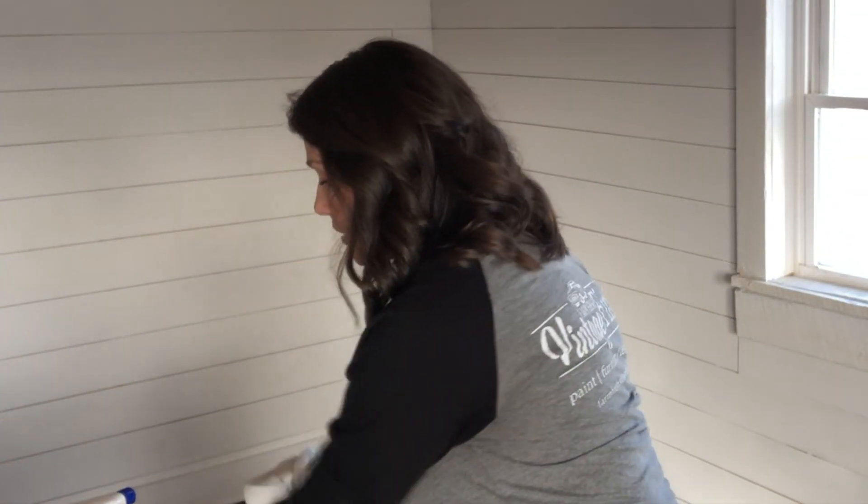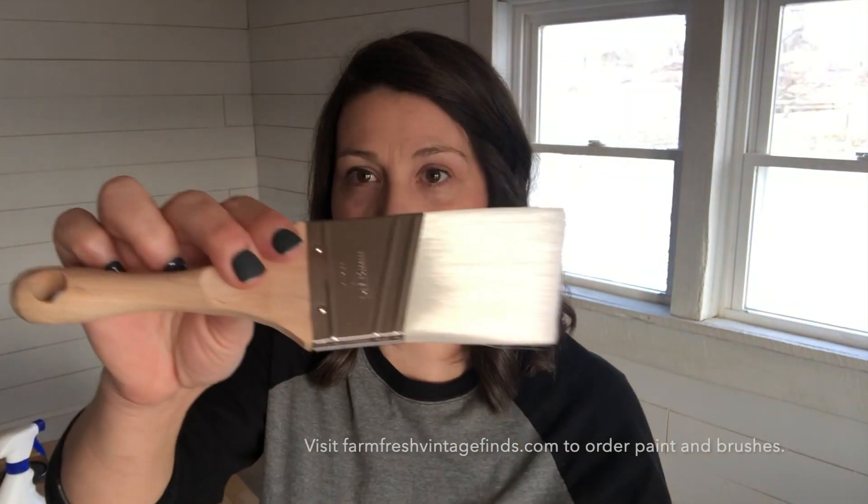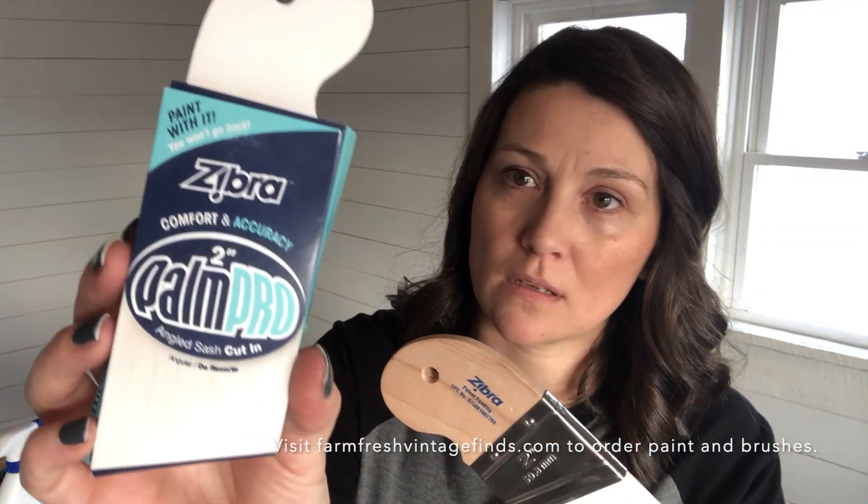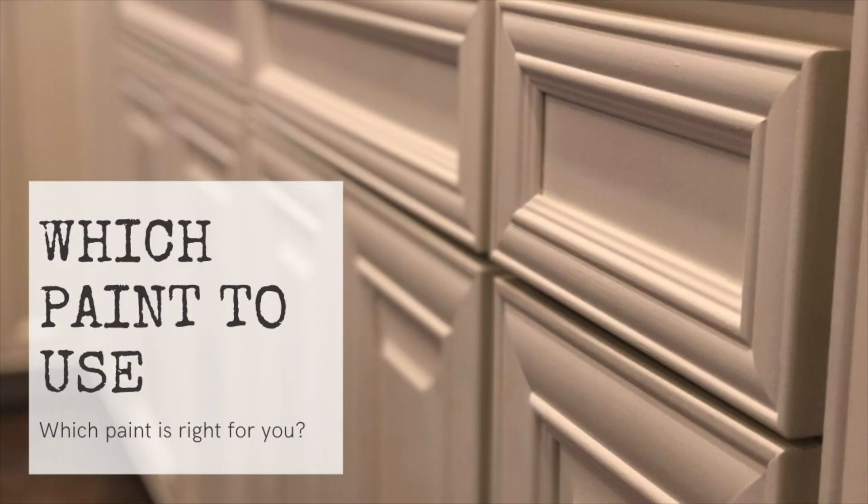Once it's time to start painting, we're going to get a really good brush. The two-inch angled brush fits in your hand really well, and then I also have the Palm Pro. These are synthetic bristles — think of like a makeup brush. This needs to be something soft because that's where you create your ability to take out the brush strokes. I love General Finishes products — their milk paints, their gel stains, their top coats. Chalk paint is one that people say won't hold up and that you have to wax it, but that's not true. You can put any top coat on a chalk-style paint. You just need to prep your surface correctly.